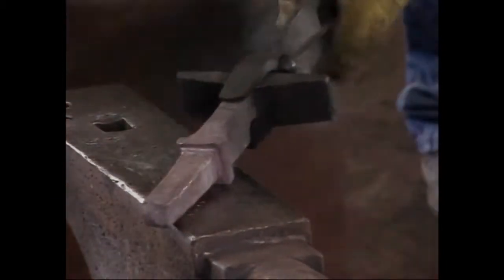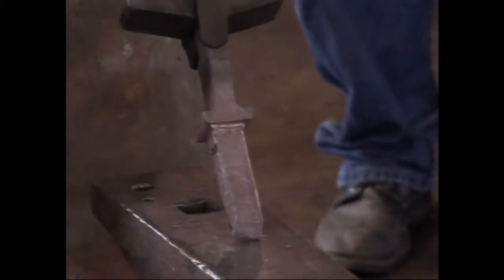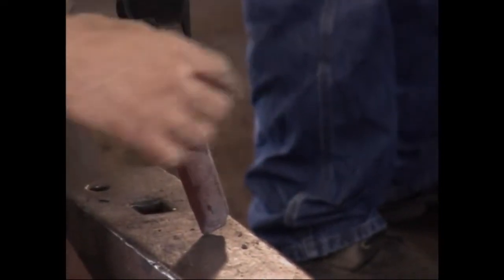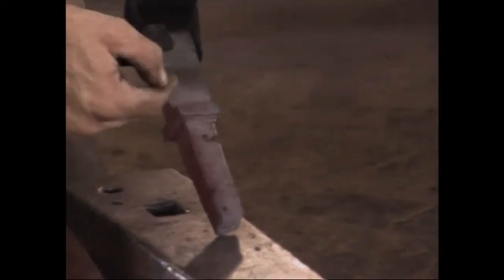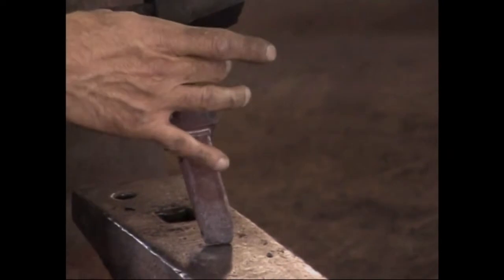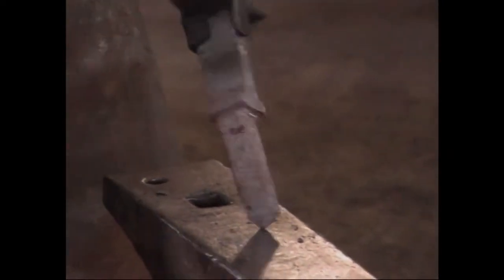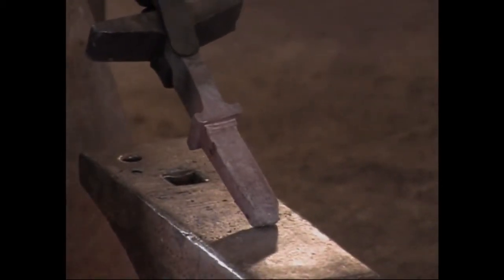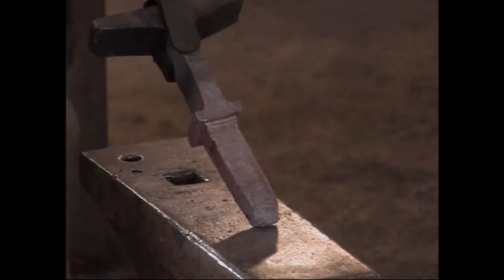After that, the tricky part is in upsetting this web down. Now, when you upset it, two things happen. One is it upsets. You'll notice it most here. It will bulge out on the sides, and that's good. Allow that mass to build. It won't seem like it's getting that much wider, a little, but you'll notice it more on the sides. But the main thing you'll notice is it'll buckle, so it's a matter of just straightening it back out as you go. Upset, straighten, upset, straighten.